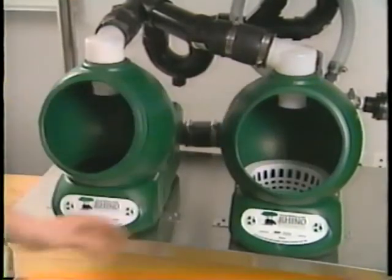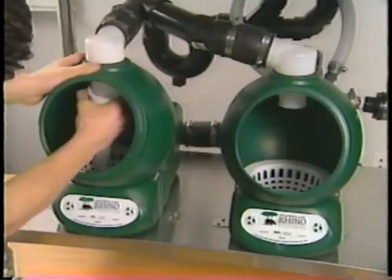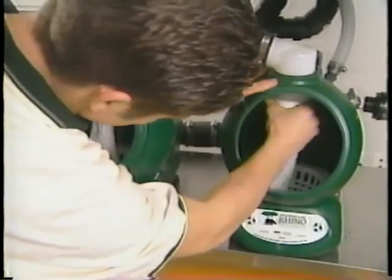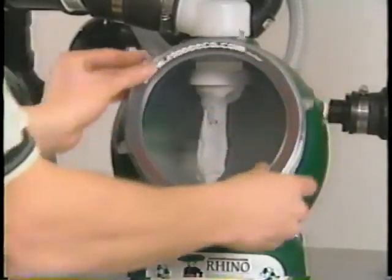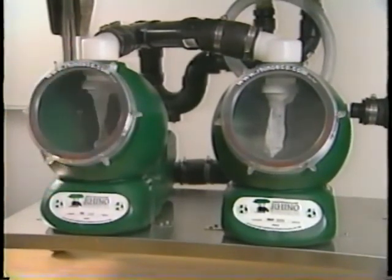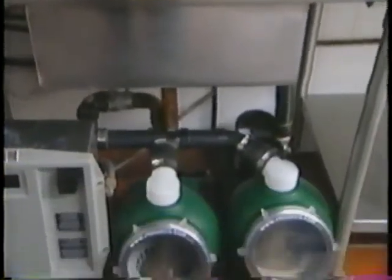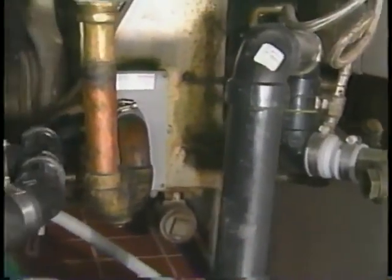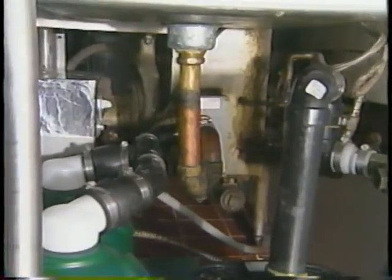Once you've got the exit line securely connected to both the gravity and simplex units, secure both units to their positions using ground brackets. Set strainers into both units and insert filtration membranes. Now plug in and run a test. You'll hear the pump unit kick on automatically for 20 seconds. Open the taps on the sink — wastewater will flow into both units. While water is running through, recheck all your connections for leaks. When water is turned off and wastewater has exited, the pump will automatically shut off.